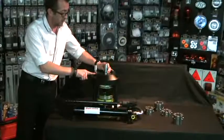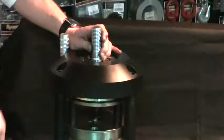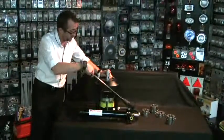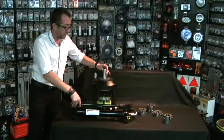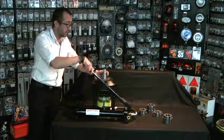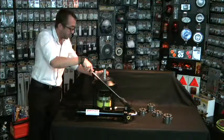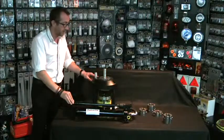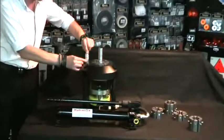With the aid of a 30mm bar or mandrel, locate down through the actual dies and close the dies up so they finish on the mandrel. Once pressure is reached against it, you can do an additional 4 or 5 pumps. At which stage you should reach the final swage setting of 30mm — this is indicated when the plunger is leveled with the top of the adjustment lever.